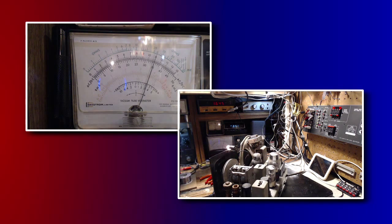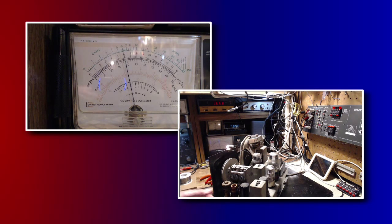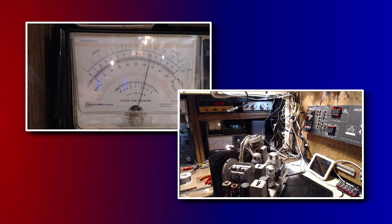signal generator? No. Gosh. We got AVC voltage rising for no good reason here. I can hear the radio quiet under it. What's going on here? Causing that. Okay, I'm stuck here. Why would there be AVC voltage where there's nothing being tuned in? Antenna is connected to my signal generator. Okay, it's no longer connected. Antenna is just hanging here open. It's connected to nothing.